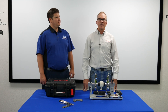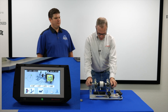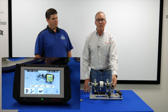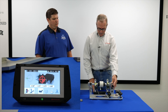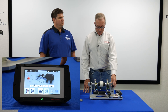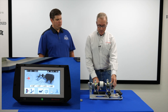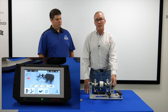Now I'm ready to measure. Once we've selected the tolerance it takes us to the measurement screen. You'll see that as I move these sensors around, the display on the screen changes and gives us the position of the two sensors. You'll see a little triangle at the nine o'clock position — I want to rotate the sensor near nine o'clock to take my first measurement. I'm going to touch on the screen and it's going to log the first measurement point. All those numbered values at the top of the screen are now zero because that's the reference point. The S value is the raw data of the stationary sensor and the M value is from the movable sensor; the angle symbols indicate where the two sensors are.